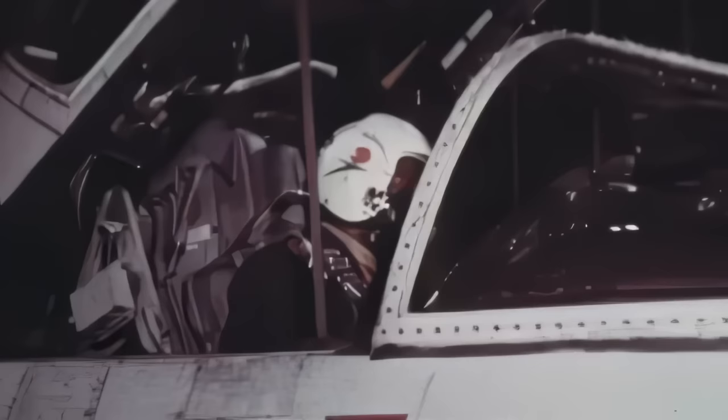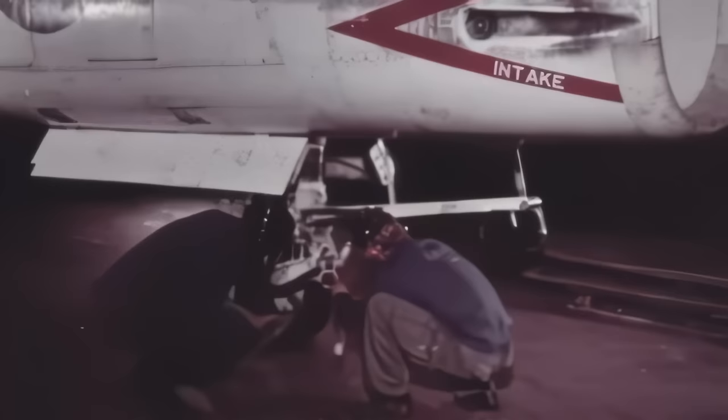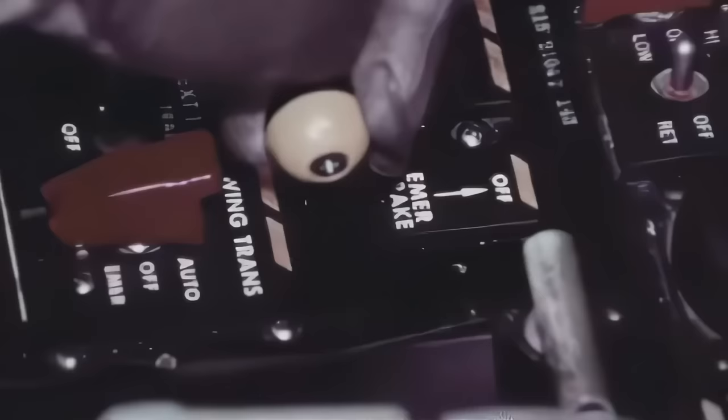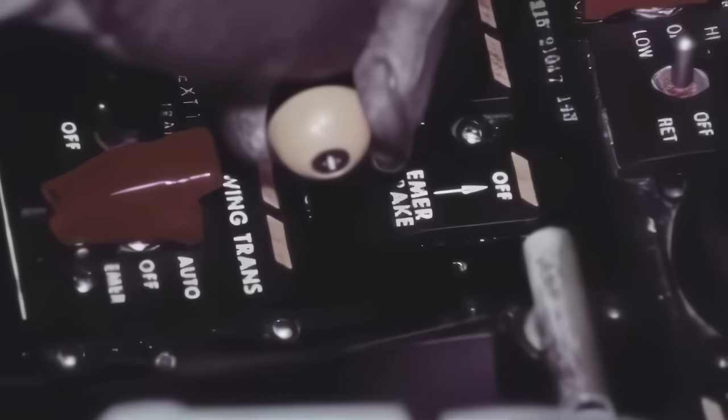Always raise flaps prior to a shutdown, even underway on the hangar deck. When you're on the hangar deck, remove your hard hat immediately after shutdown in order to hear whistle signals from the director. Once you've stopped, hold the brakes until the plane is tied down. Remember, you have a maximum of 5 brake applications after shutdown, so keep your hand on the emergency brake handle.